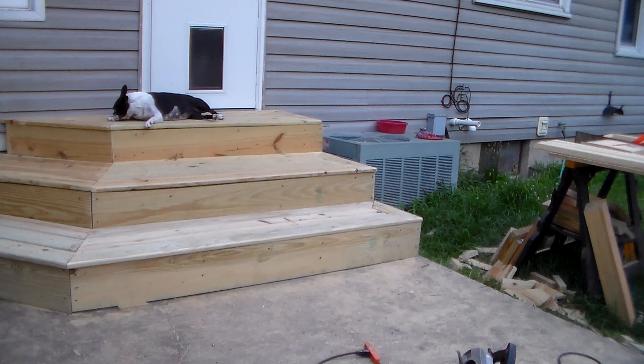I bought some, I think they call them balusters, and it's pretty much pre-made handrail boards. I'm just gonna screw them to the side over there, and then I'll rip a piece of this 5/4 board and screw it to the top. We'll probably router it off, and something to that effect. I'll let you know when I get done what I did. I hadn't really planned that far ahead yet, except for that I know I needed to do it.